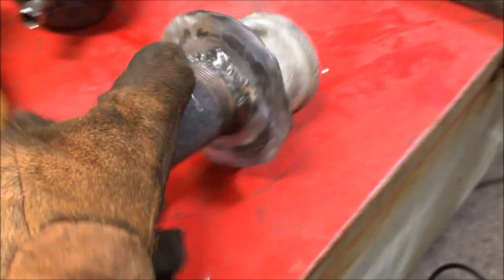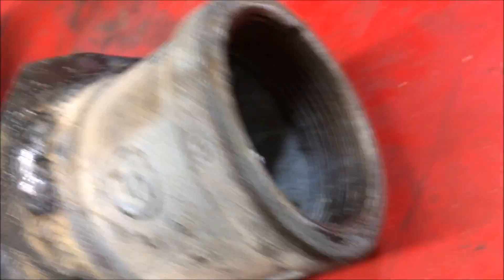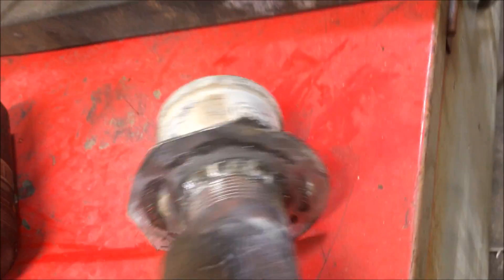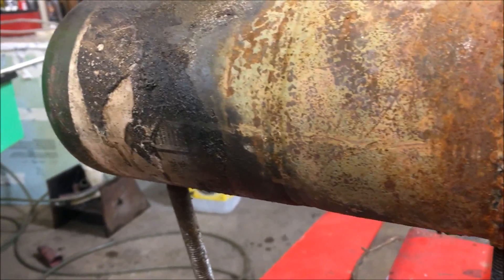Here is the burner nozzle — not the oil nozzle. I wanted that little inner shroud so we would get a captured flame holder right there to superheat this area. I wanted that to be a nice big hefty piece to retain some of the combustion heat, keep this nozzle nice and hot, and hopefully transfer a lot of that heat back into the burner. I might even weld a couple pieces of rebar to heat up this area — we need heavier metal to transfer some heat back to this intake.